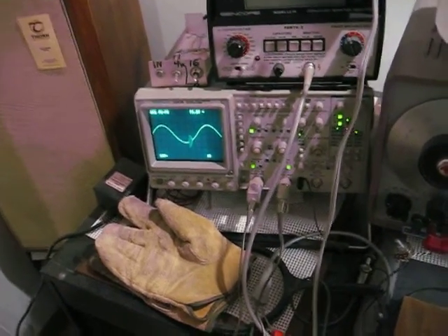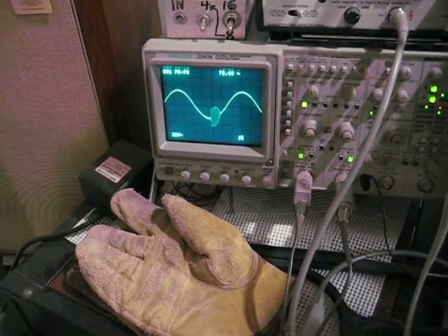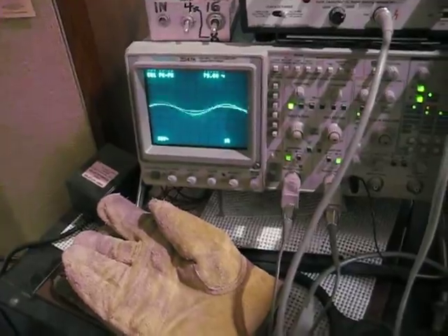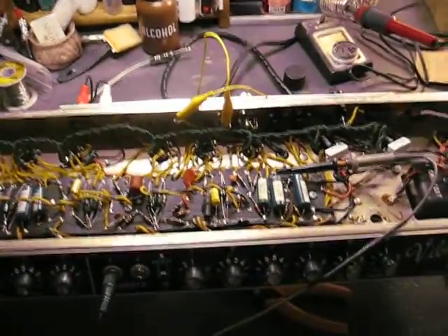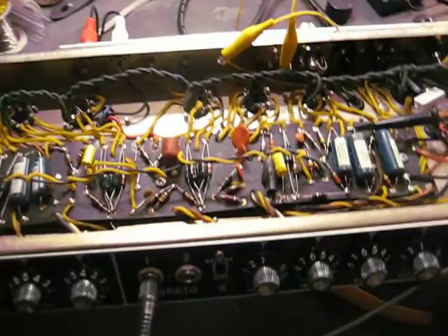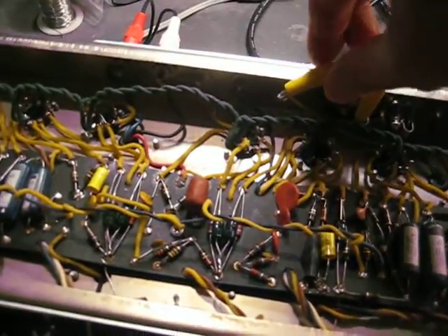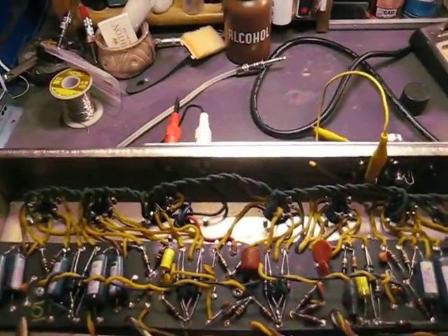There you can see the oscillation coming in. It's kind of a ratty sound — it's almost like a blown speaker, but it's not. To indicate that it is the negative feedback loop causing that, we'll disconnect it right now.